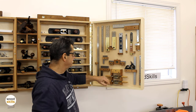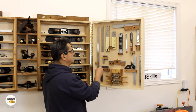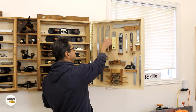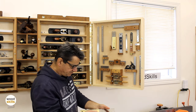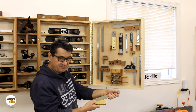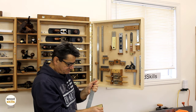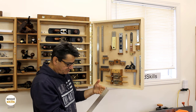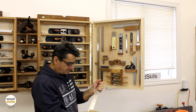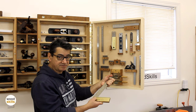These tools are quite interesting — I purchased them years ago, I think clearing them out somewhere. They're very high-precision angle gauges, preset at different angles — 22 and a half, 45, 67, 90 degrees. They're incredibly accurate; I've measured them against more precise tools and was amazed at the precision. It's a quick and convenient way to get the common angles used in woodworking.